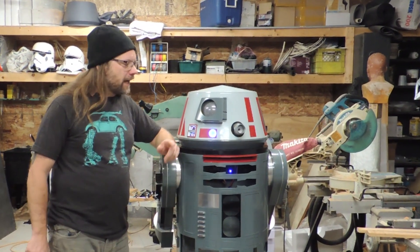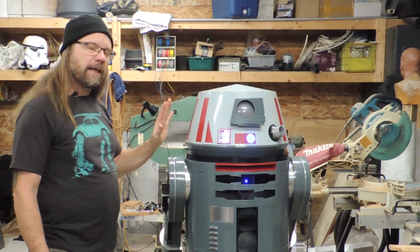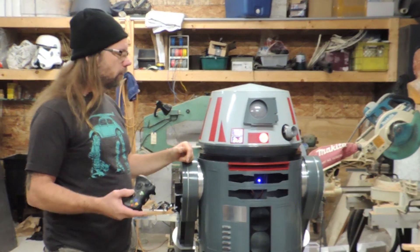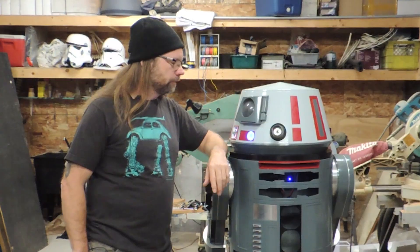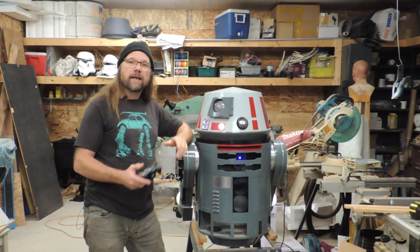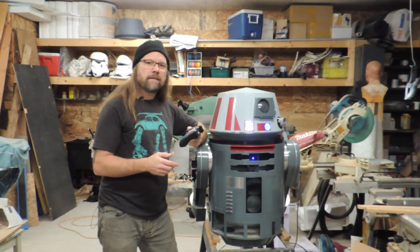So that brings us to where we are today. I'm pretty happy to have the dome spinning and the logics lit up. I've found a few problems today — one of them is the occasional slip in the friction wheel that drives the dome — but I've got a couple ideas on how to fix that already. The controller script running in the body is very much a work in progress; it only has the bare bones needed to read from the Xbox controller and spin the dome. As I refine that, I'll certainly share what I'm doing there. I just want to apologize quickly for how sporadic my uploads have been. Life does seem to get in the way sometimes, but I'm going to really try to tighten things up. As always, if you find this stuff interesting, please subscribe to my channel. And until next time, remember, there is no try.